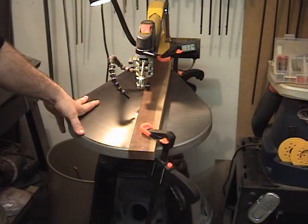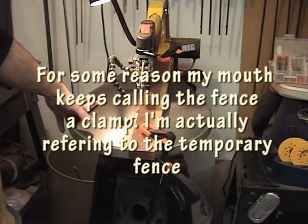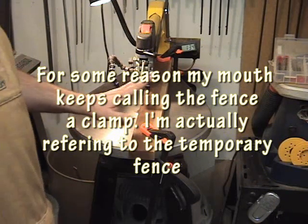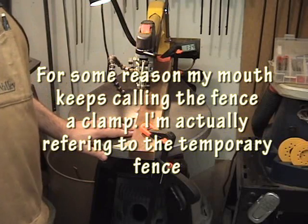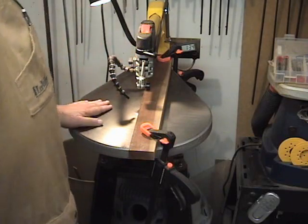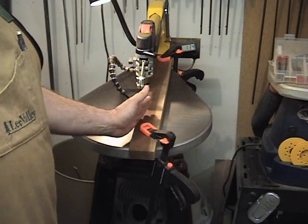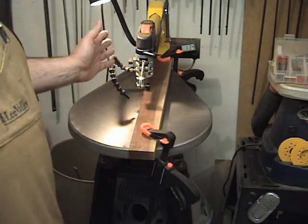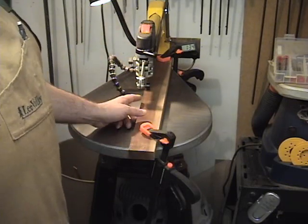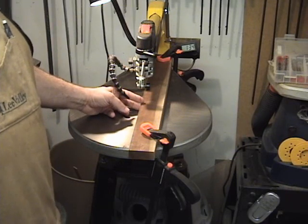Here's a long shot of the setup and how we're going to try to do this. We need a clamp to do this re-sawing because I tried doing it freehand and you can do it, but it's a little difficult. All I've done is taken a board with a pretty true edge and clamped it to the front and back of my scroll saw. I was going to set the angle to compensate for the drift of the blade, because scroll saws don't cut on a true front-to-back angle — they're usually angled a little bit. But these blades I'm using appear to be precision ground because I'm not getting any drift off of them at all.